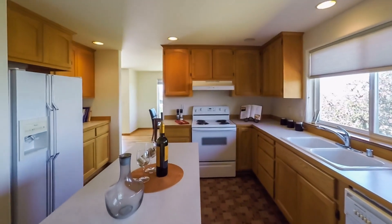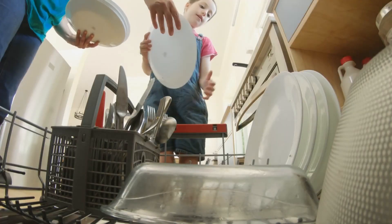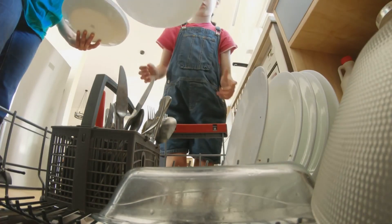We're also going to do calculations on estimating daily energy demand based on the customer's appliances. This is where you do a load sheet, check out what the customer's loads are, and calculate daily maximum demand of energy.